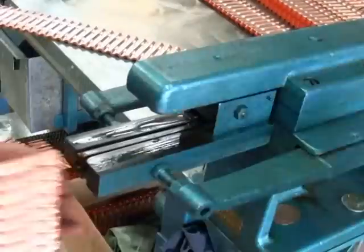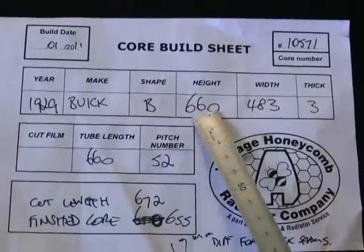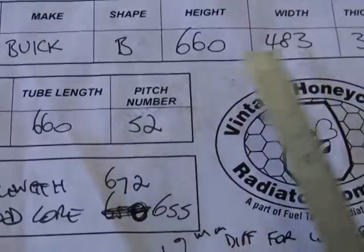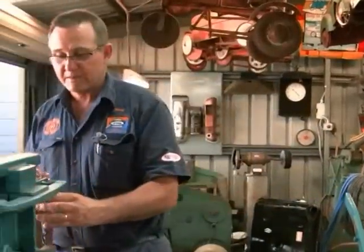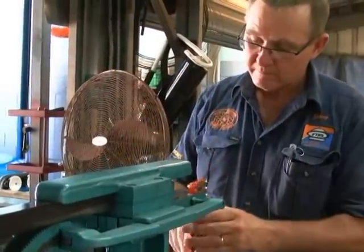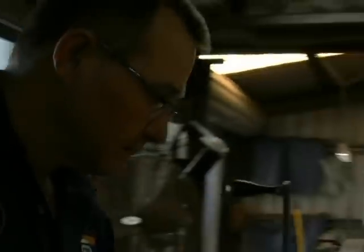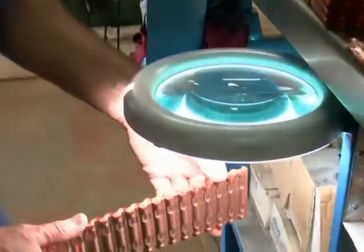On this particular core, the 1929 Buick, we look at the build sheet. On the core build sheet we've got the year, the make, the shape, the height, the width. It's going to be 483 wide, so I simply divide 483 by 9.3 millimetres and I come up with a pitch number of 52. That means I need 52 tubes. For quality assurance, I'll take one occasionally and bring it to my craft light — ladies will recognise this for sewing. Once under this light I magnify it, look at my double rolled lock seam, and confirm I've got full coverage.